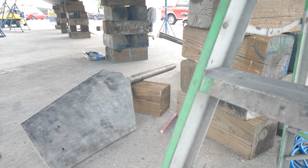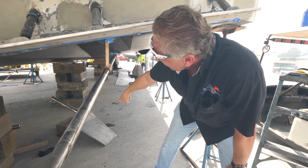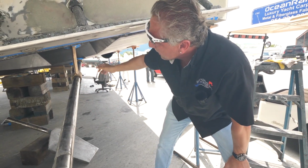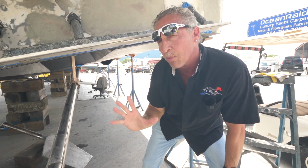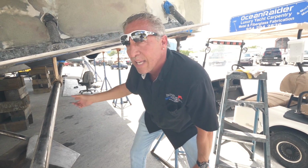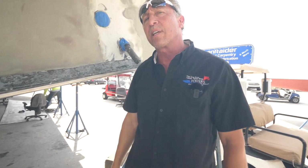Also, if you see, we dropped the rudders. We're going to be changing the rudder seals in the carriers. As the rudder table over there, the seals were bad in the carriers. So we're going to change that, put the rudders back in, and then the only thing that's going to have the prop speed application here will be the shafts and the props. Everything else will be done in the Trilux 33, as I just previously explained.